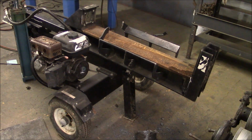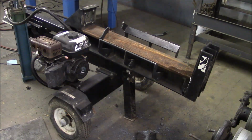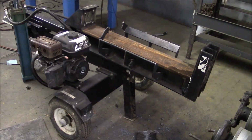Okay, I cut the plate and got it sitting in there. That's the rough outline of what it's going to look like when we're done. Except I need to call in and get my machinist calibrated eye recertified, because this plate is actually 3/4 of an inch thick, so 19 millimeters. So it's basically double the thickness of the original web. And if we screw that one up, we got a way bigger problem. Also had to go at straightening these cradle brackets, just BFH, and they look pretty good. So I am going to get things cleaned up and do a lot of welding.